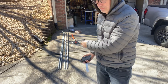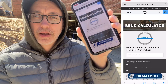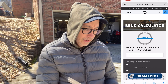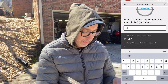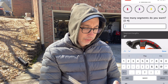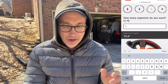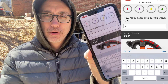I bought four pieces of 10-foot conduit and a pipe bender, which I've never used before — I'm excited to try it. I've also got this handy bend calculator that lets you type in the desired diameter. Eight feet is 96 inches, and I'm going to use four segments instead of three because the three looks a little triangular and I want it to be more round. So I need four segments that are 75.4 inches.